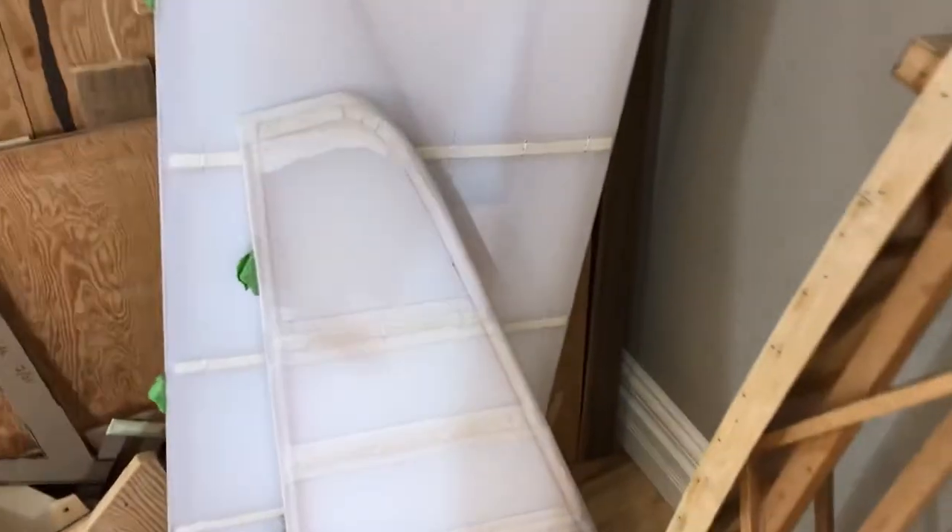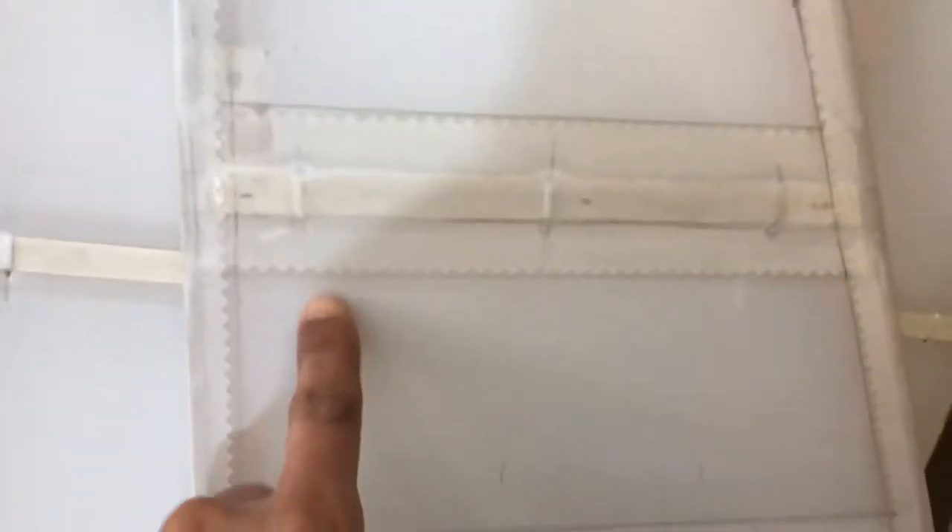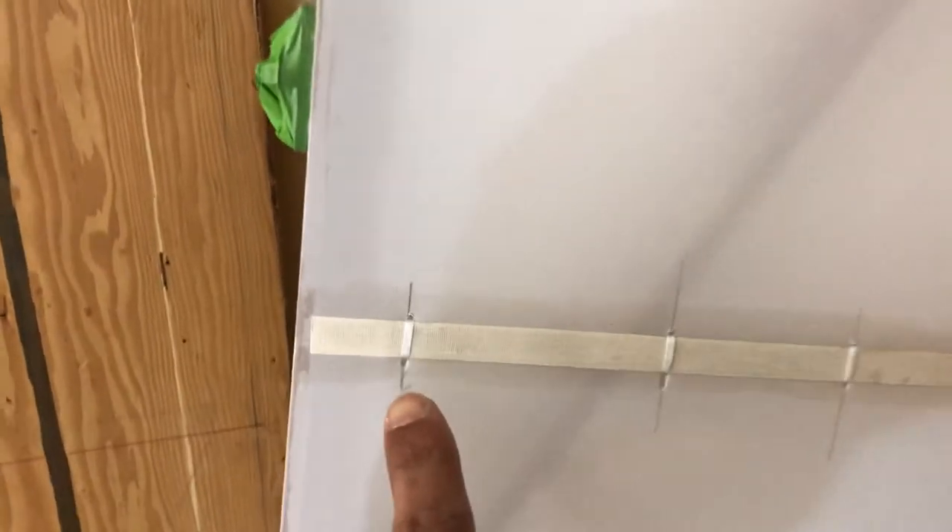When you're done you cover it with the finish tape — the 2 inch tape — and then at the end you take a 3 inch tape on the wings and cover it down around the edges. This is the vertical fin that's done, pretty much ready for final shrinking and paint. It has 2 inch tape covering the rib stitching and a 3 inch tape on the edges all the way around. It's tacky and sticky, but once you hit it with primer it looks good. Here's the horizontal — it needs the finish tapes: 2 inch here, 3 inch on the ends, final shrink, and paint.